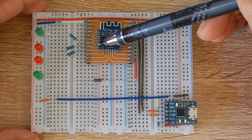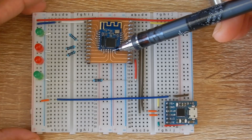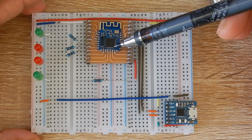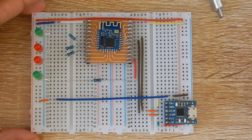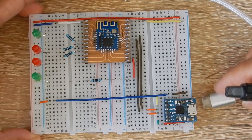The module has 8 user controllable output pins. Four of which can either be set high or low — those are on pins 8, 9, 10, and 13. Pins 7, 14, 15, and 16 are outputs with PWM functionality.